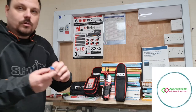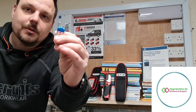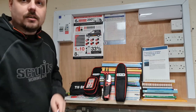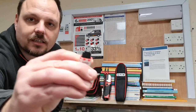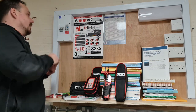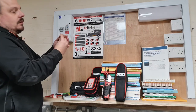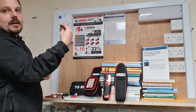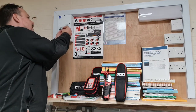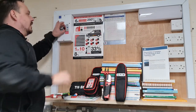There are a couple of variants. One locks around the outside of an MCB, or in this case the RCD that we're going to demo on. This one kind of locks on the inside — a similar principle but just different ways of attaching. You push the black part in so it's extending the prongs, then you pop them into the holes on the RCD, and that now can't be operated.